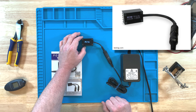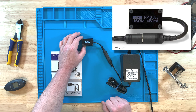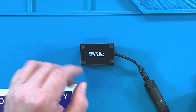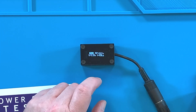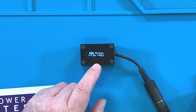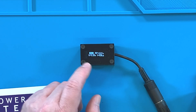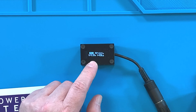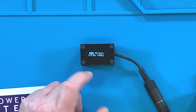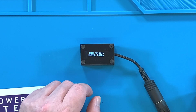This measures the 5-volt DC output and the ripple at a constant current of roughly 400 to 500 milliamps. Right now on the display it's pulling 439 milliamps from the power supply to put it under load, and showing that while the power supply is working, it's able to provide 5.2 volts, which is great for your Atari computer.